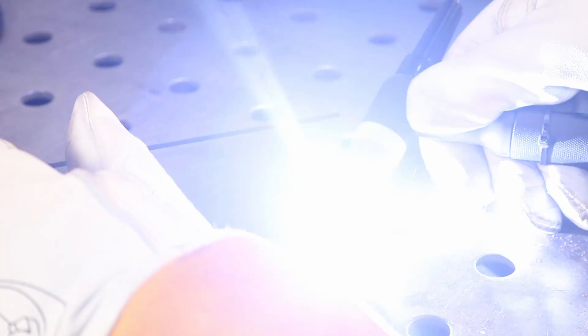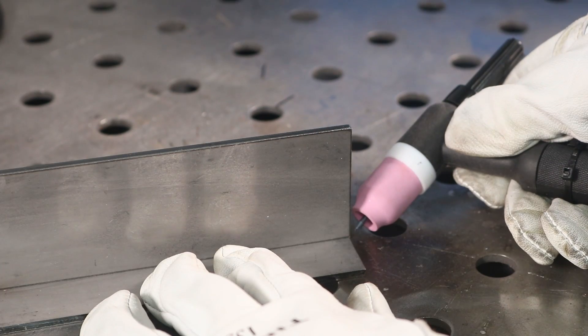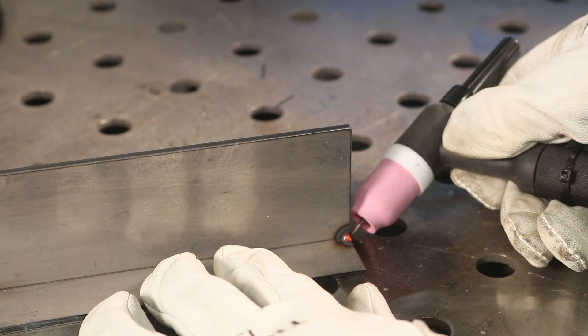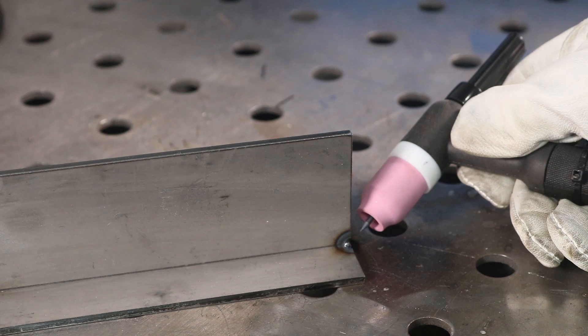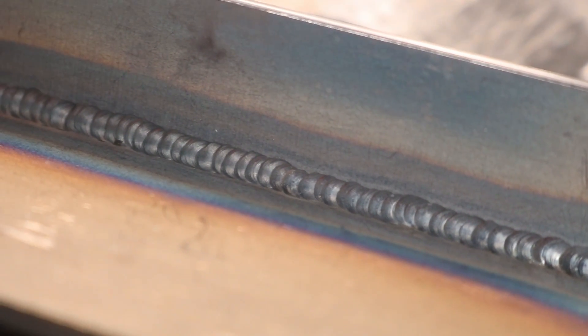Okay, so I'm going to tack up these one-eighth-inch thick coupons, and you can see how that high frequency arc starting just made it real nice to light up an arc — I got a good tack on there. Sometimes you do have to touch the tungsten electrode to the material just to clean it off and then you'll get it to strike an arc real nice. Another nice tack on here; I'm just putting together this T-joint to run a fillet weld along here and test out the capability of the machine — how it runs on TIG, how smooth the arc is. I'm just maintaining that consistent angle and short arc and adding the filler right into the pool. And we've got a pretty good result here, definitely happy with that run.